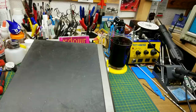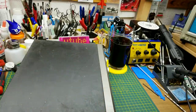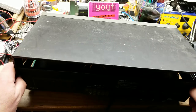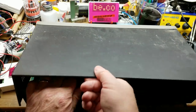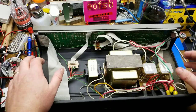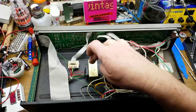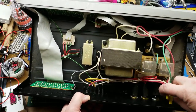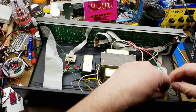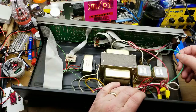I'm just going to pull the lid off this thing — it's got four screws, two over there and two over here — and hopefully I'll be able to get it onto the bench so we can see what's inside. There we go. So what do we have inside here? Immediately I can see two big relays, a serious power transformer, a slightly smaller one. There are the fuses down there and simple marettes — some people call them wire nuts — holding all the AC mains wiring together. And that switches the mains directly.